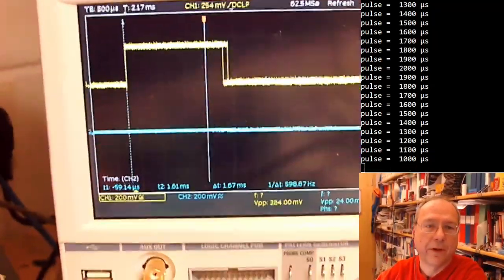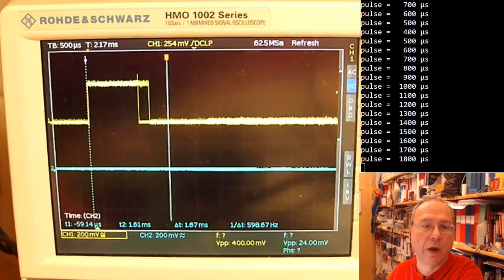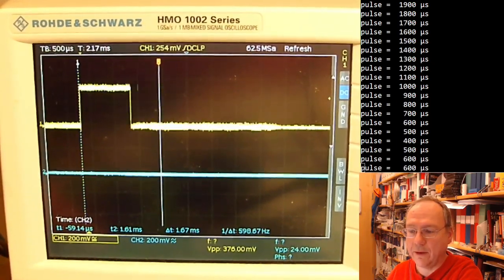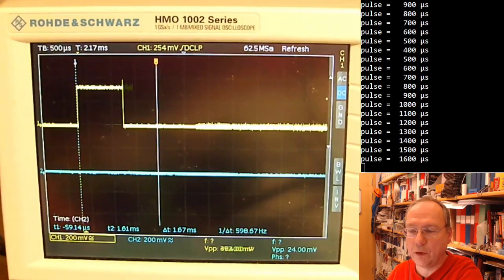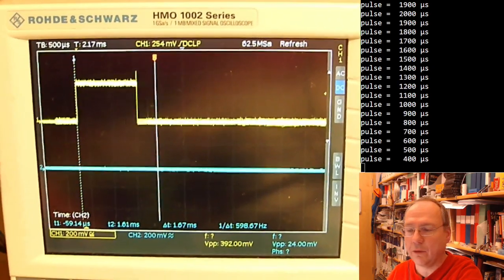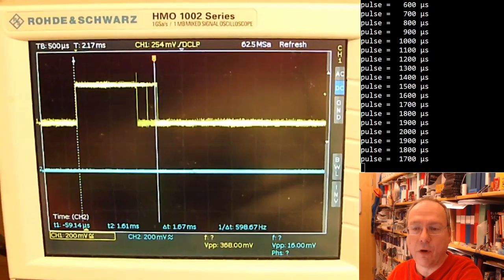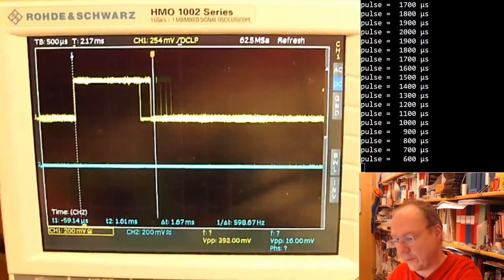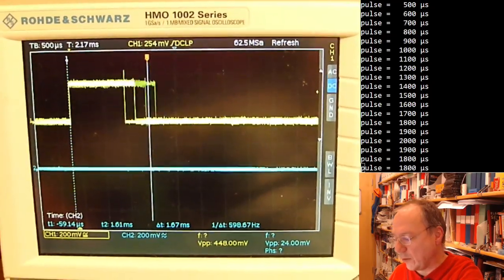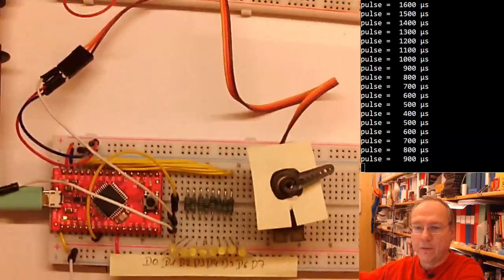So follow me to the scope. The yellow curve shows you the pulses which we are sending to the motor by manipulating the value on PB5 on the pin, and this is then the input signal which tells the motor in which position it should position itself. So the shorter the pulse, we go to one extreme side of the motor, and the longer, we go to the other extreme side. The supply voltage to the motor is on all the time, so it's always connected to the +5 volt from the USB bus, but depending on the pulses which we send it, the motor will either go to the extreme left or to the extreme right.